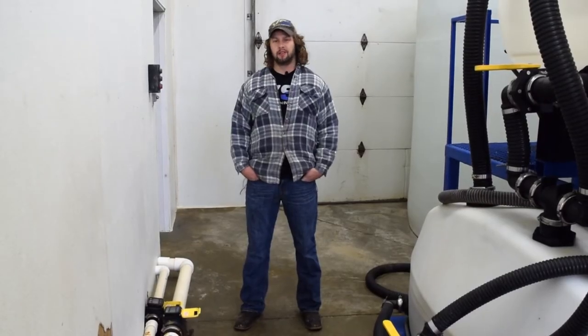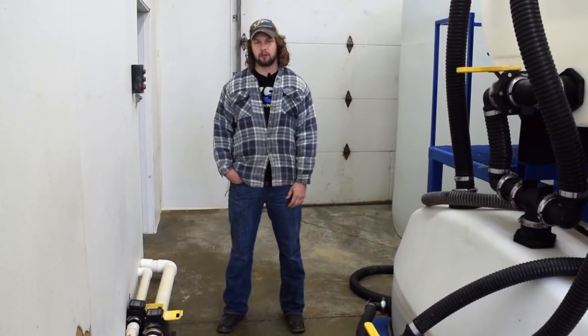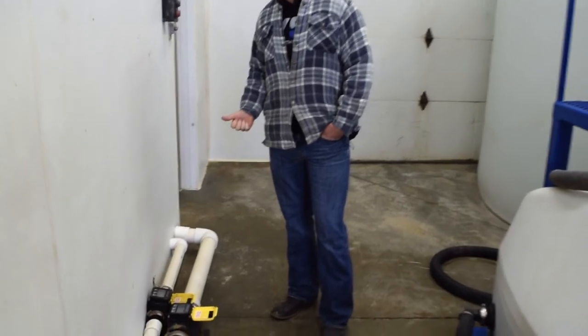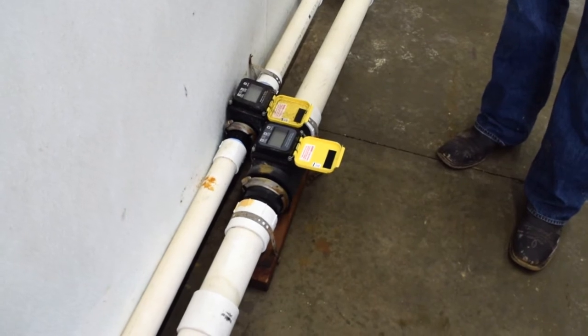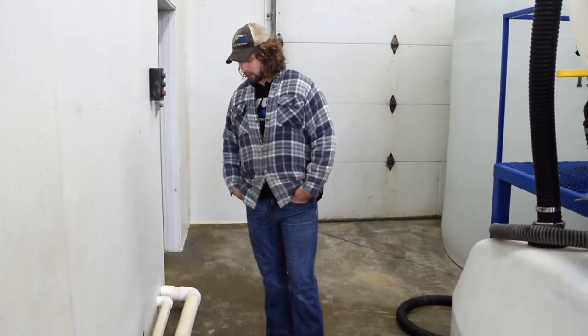Our systems are not automated but they're very easy to use — one guy can make the brine and pump in and out with just a series of valves. We added two digital inline flow meters that monitor the brine and calcium chloride coming out of the system. It's great for tracking how much goes in each truck and makes mixing simple. For example, with a 1,000-gallon sprayer at 80-20, you need 800 gallons of brine on the three-inch line and 200 gallons of calcium chloride — it takes the guesswork out completely.